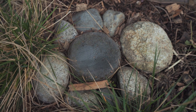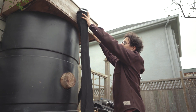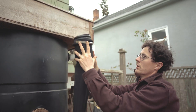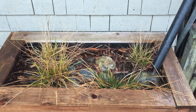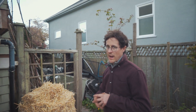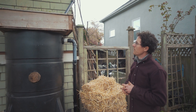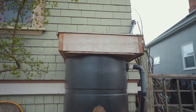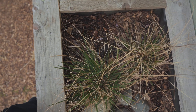On top of that we have a screen that just gets hose-clamped on. When it rains, the first ten liters gets absorbed by the plants in the wetland box — since it'll usually be dry when you get those first nasty rains that flush everything off the roof, the plants take that up right away. Then water flows through the sock and down. In heavy storms the water fills up and flows down through the open pipe. The wetland box has peat moss and compost, so it takes care of bird droppings and other roof debris, and actually feeds the native grasses planted on top, which really enjoy that high fertility.